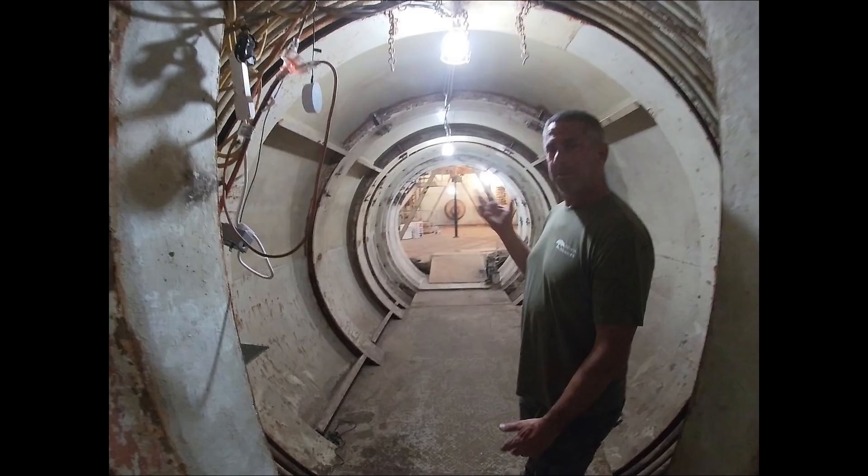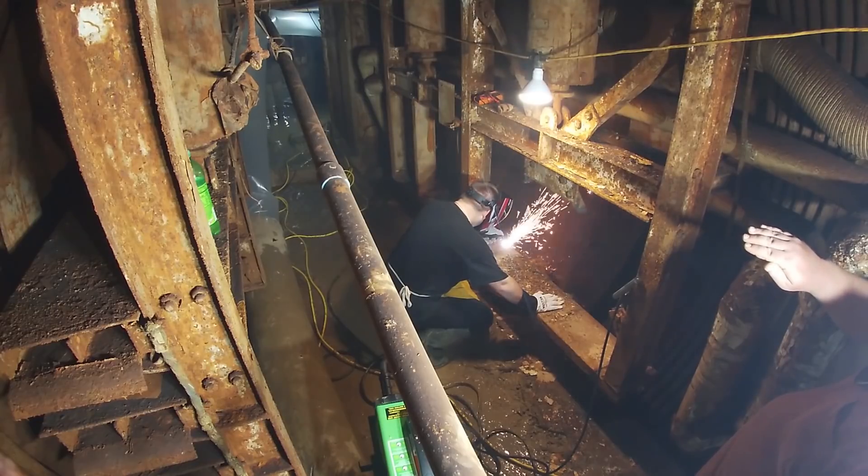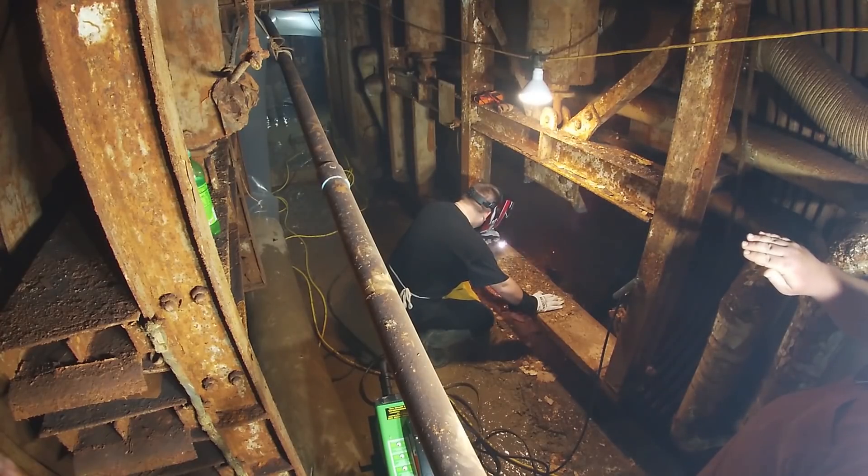So I'm going to start playing the video now and we're going to get into the actual scrapping of our short cableway. As I begin the cut with the plasma cutter here, you can see about the approximate speed we're able to cut through this thick I-beam. These things are about a quarter inch thick, and you're able to cut through one in about a minute, minute and a half.